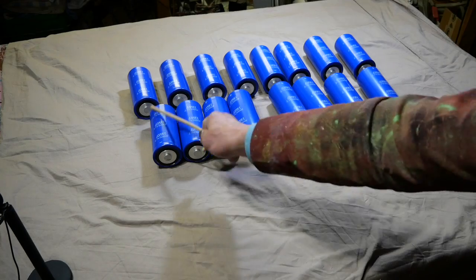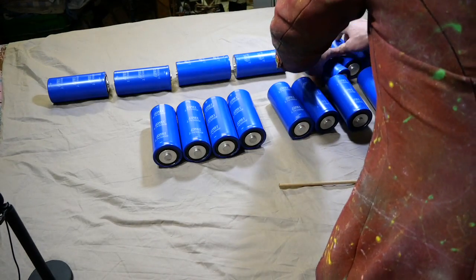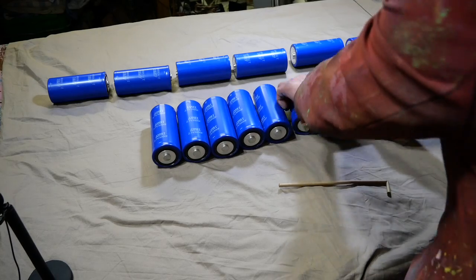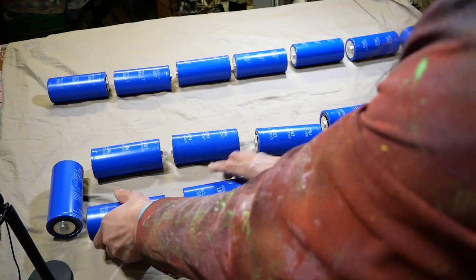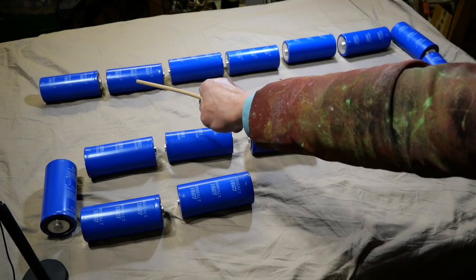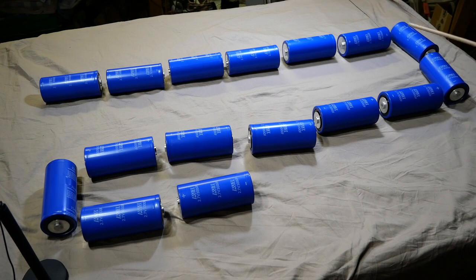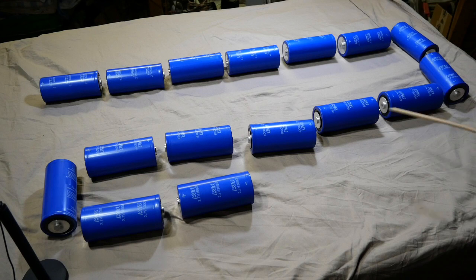So when people are impressed by the 3000 farad number — when we put all 16 together in series, 8 in the positive rail and 8 in the negative rail, with ground in the middle — each string or rail is 3000 farad divided by 8, equal to 375 farad. So the positive rail has 375 farad, the negative rail also has 375 farad, and added together equal to 750 farad. So when I said I'm building a 750 farad power supply at plus or minus 15 volt...